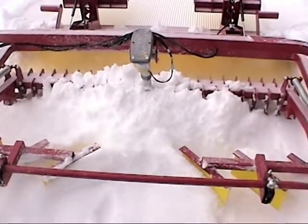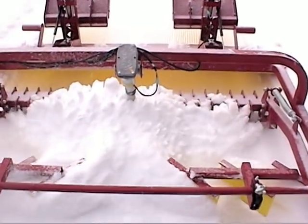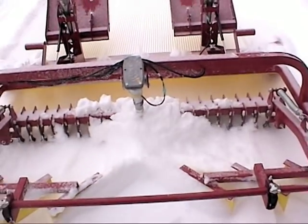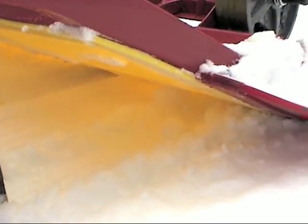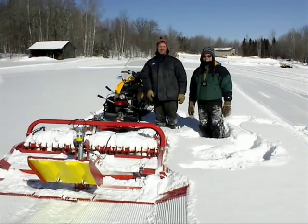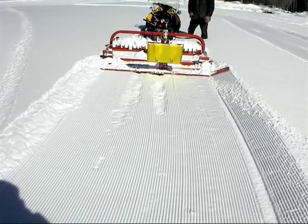Fresh snow passes through the snow transfer blades and accumulates ahead of the teeth and tooth bar. This rolling accumulation is available for leveling low spots and also helps to remove air from the snow, maximizing density. The third component in the G2 system is the free-flowing compaction bed. This non-stick, ultra-high-density plastic bed maintains a smooth curve as it compacts the snow passing through the tooth bar. The free-flowing compaction bed is one reason the G2 is easier to pull than any other comparable width implement on the market. Take a look at these pictures of the G2 in 18 inches of unpacked fresh snow. Although we recommend prepacking snow this deep, the G2 will actually pull through just about anything your snow machine can handle.